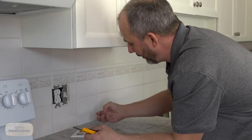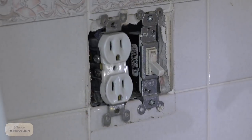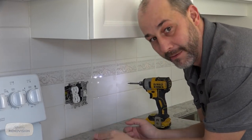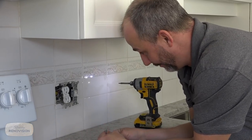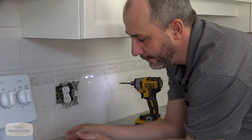What we've got to do is remove all of the electrical stuff — take these out because they're going to need longer screws when we come back. If you don't feel comfortable playing around with live power, turn it off. Go downstairs — most new homes have breaker panels labeled for kitchen. If not, you can always apply some black tape just to make it a little bit safer.